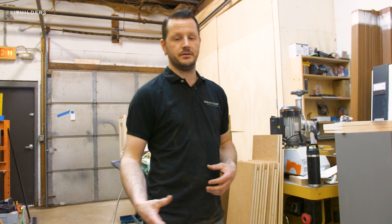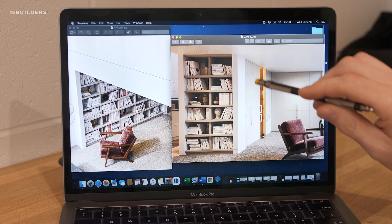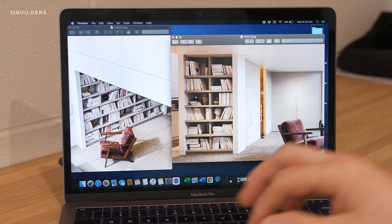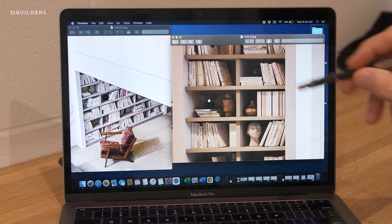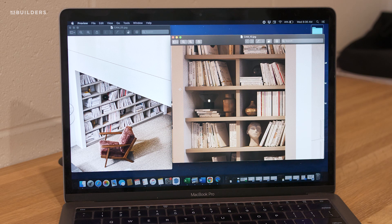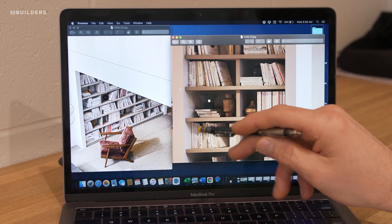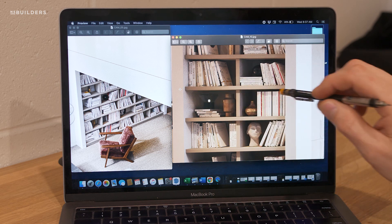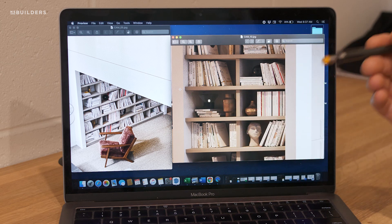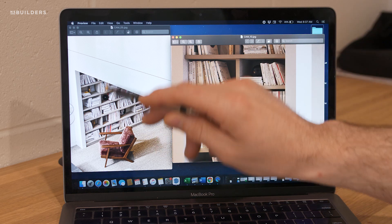Here in the office looking at the smaller bookcase rendering, you can see what I meant by the case being plastered in. It looks like it's just a wall that the shelves float between, but we actually made each edge and the top cabinet sides that will be painted with the walls. We added a mud flange to the side of the case and plaster up to that point, giving a seamless look while still having the structure and stability of a plywood case. These bookshelves are going to hold quite a few books, so we also have a cleat behind each side and running through the back.